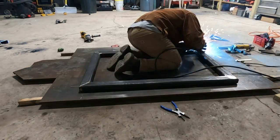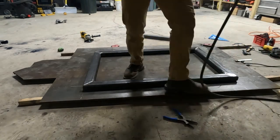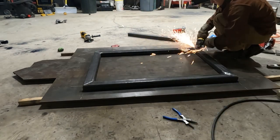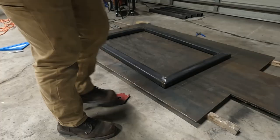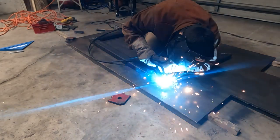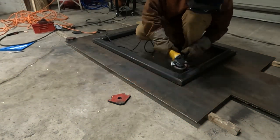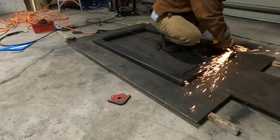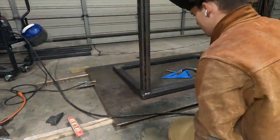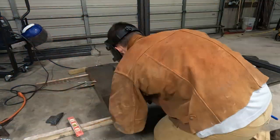A little bit of teeter-totter to it, and that's kind of why I did the adjustable feet. If you just have caster wheels on the end of the foot post and there's wobble, you're kind of screwed. So having the adjustable feet will give me the ability to take out any unsquareness or wobble, because I know I'm not going to build it perfect. And it kind of saved me because I didn't make it perfect in the end. And here's me putting up the post. It was a little tough to get these perfect, but they turned out just fine.